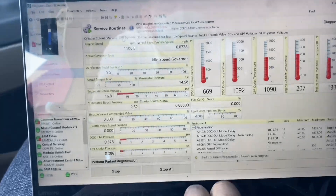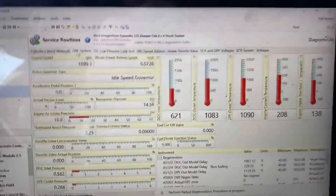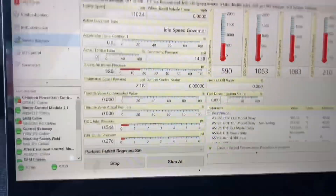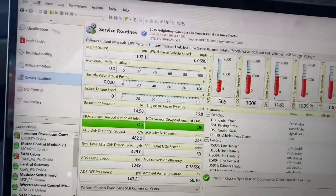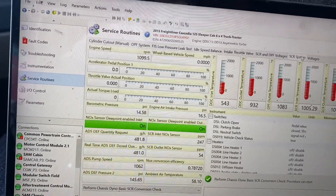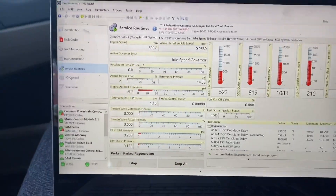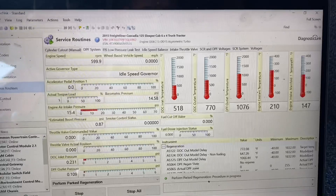We are actually done with the regen. Those are our temperatures — not bad at this point. It's going to start cooling off, which is normal. RPMs will still be up and that will start to drop as it cools off. This has actually been really successful. Those other codes are not related to the code I'm looking at right now, which is 3246 FMI 0 — so that's pretty awesome. Let me check the NOx efficiency — 78. Not bad, actually. This filter still has some life left in it. The one box, the SCR, the DOC, the DPFs — pretty good. The fact that we're at 78, almost 80%, not bad. Do a regen where it's safe — don't do it next to dry materials. Let it cool off.